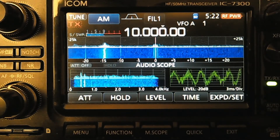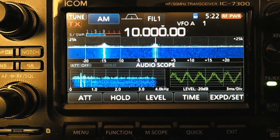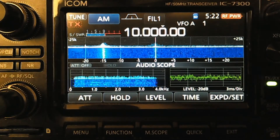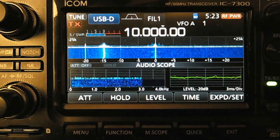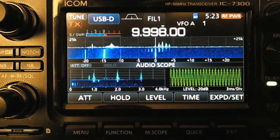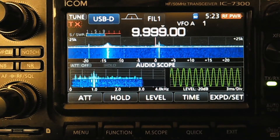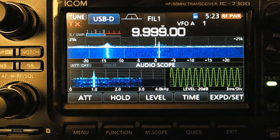So how do we do that? Let's calibrate this ICOM 7300. The process is going to be different for every other radio — I haven't actually tried any others. What I'm going to do is get this out of AM mode, put it in single sideband — upper sideband — and come down about one kilohertz. So this is now going to say 9.999. And that's the tone you're interested in. You're hearing that carrier; you can see how elegant the sine wave is right here.